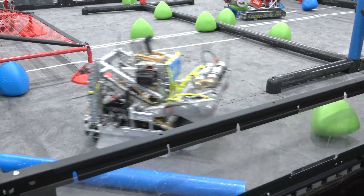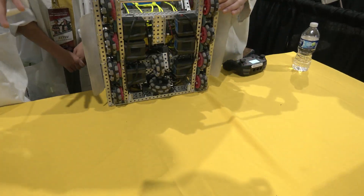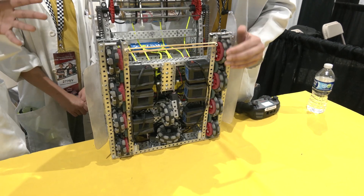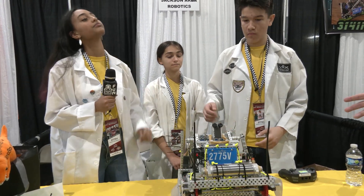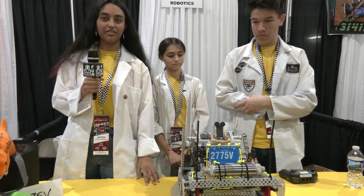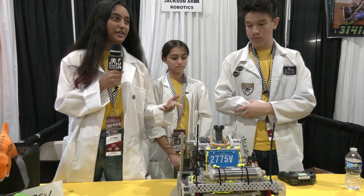On the programming side, they use tracking wheels that allow the robot to track where it is on the field. They run two controllers: one for the robot and one for the field. The robot controller uses a PID — proportional integral derivative — controller. If you tell the robot to go forward 12 inches, it sees how far it has to go and figures out how much to accelerate and then decelerate so it doesn't overshoot. Odometry treats the field more like a coordinate plane, letting you tell the robot to go to a specific point rather than just a relative direction. The PID handles speed while odometry handles position accuracy.